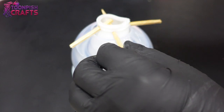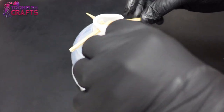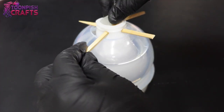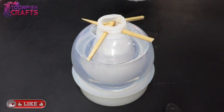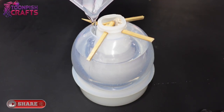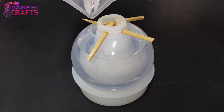And once, like I said, you've got the right weight, then if you make it again, you use exactly the same amount of stones the next time. So after a little bit of faffing around, I made sure that it was centred, that it wasn't down too far, and that it wasn't floating. And that is the main points. This light bulb mould is quite small compared to the sphere mould. I could have used a smaller sphere mould, but the next size down I had was too small.